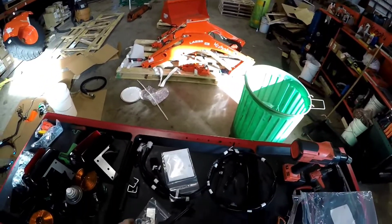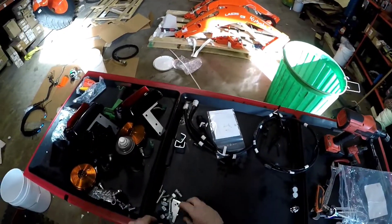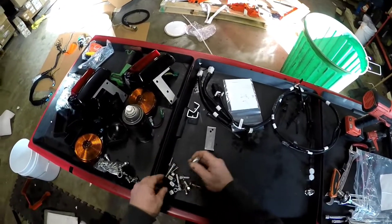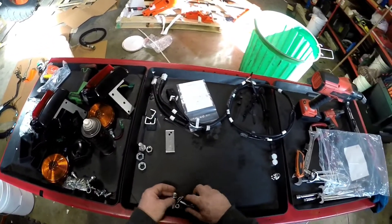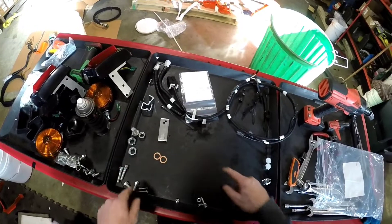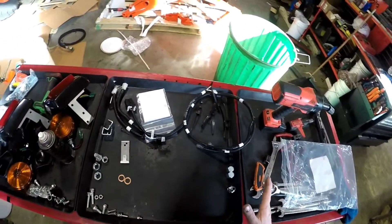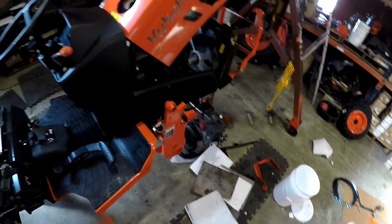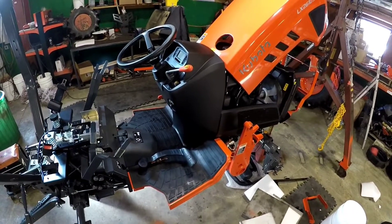This guy's getting a lot of good stuff. I'll sneak over the parts and slap some flat face fittings on there for him — save the guy a headache. Got a little relay bracket here. Big bolt, big nut, another big nut, long bolts, shorter ones, a couple long ten-millimeters, two crush washers. And that's the third function valve for this machine. Let's start on the tractor side.